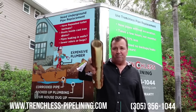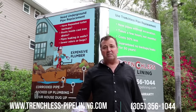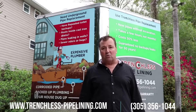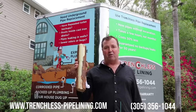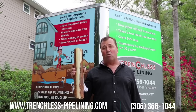Eventually the pipe gets so thin it cracks, and then the crack widens until the cast iron has serrated edges. The serrated edges on the bottom catch debris and cause repeated backups. The reason you're probably watching this video is because a plumber told you that you have to dig up your home or building to replace all these pipes. Well, since 1998, cured in place pipe lining has existed to restore those pipes, and it comes with a 50-year warranty.